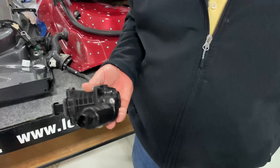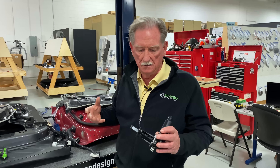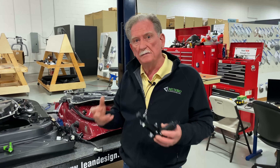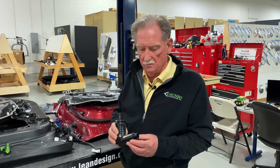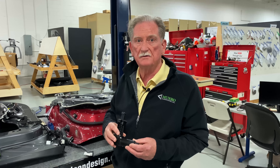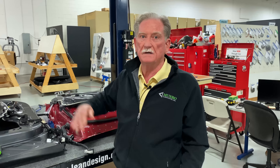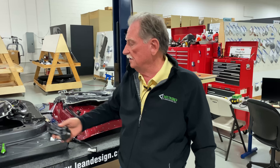But again, here's the same question: why do I need all these screws? How many times am I going to take this apart? Never. Why the screws? Why bother? Let's start thinking about how we make this safe — and one part is a lot safer than ten. How do we make it safer and less costly? These cars cost a lot of money. Any time you can remove a threaded fastener, any time you can make it a snap-together design, nothing bad happens. We do this all the time for medical devices, and medical device quality standards are extremely high. We can make that happen.